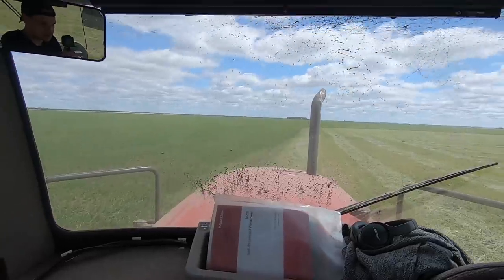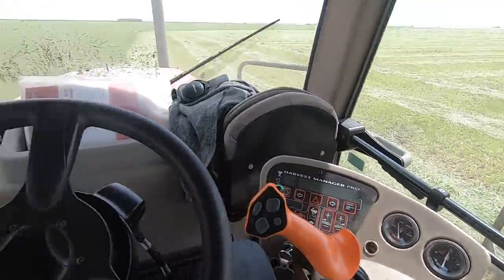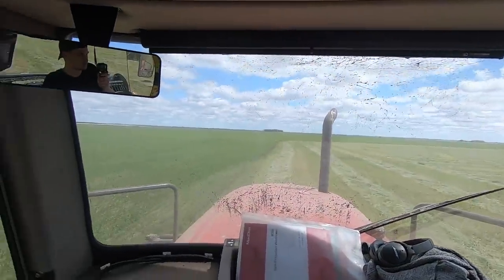So this is what it looks like when it's in dual direction mode. The header is just behind you — the steering wheel and everything is all facing that way. It's pretty handy. The swather actually lets you drive quite a bit quicker — it's got a governor when you're driving that way. This way it lets you go like 10 to 15 kilometers an hour quicker. And if you have a really wide header, like a big 40 foot draper header with transport mode, you can just drop that down in the field, hook it up behind you, and rip down to the next field if you've got a ways to go. We don't have the transport on our big draper header, but it's handy if you ever need to go somewhere without a header.